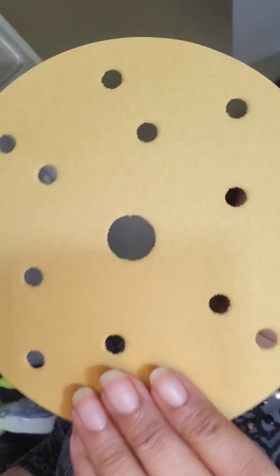And then finally I'll finish it up with the 240 grit, which is extremely fine, and you use that to just make sure that the wood is extremely smooth. I am going through this trouble because I want the top bare. I want the naked look of the wood. The parts where I am going to paint, I am just going to use an 80 grit sandpaper and just roughen it up a bit. You roughen up the edges so that the paint can stick onto a surface. So let me just show you as I go. It'll be easier to explain as I go.